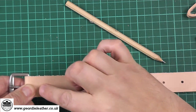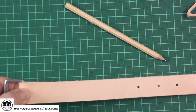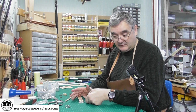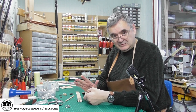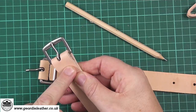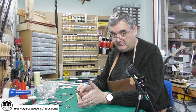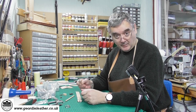There are various methods for fixing the folded part of the strap to itself. As you can see from the sample, I stitched it — this is the strongest method and the recommended one for making quality belts. A lot of modern belts are simply riveted with a single rivet which over time will fail and come apart. You can put one or two rivets for extra strength. If you want to use a riveting method, I suggest copper rivets — they're much stronger and basically indestructible, so for long-term belts copper rivets are the way to go.